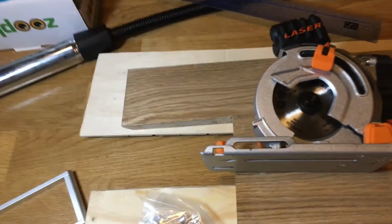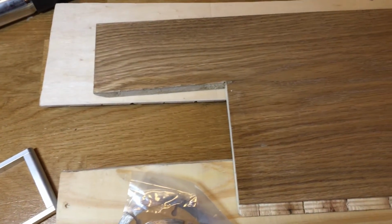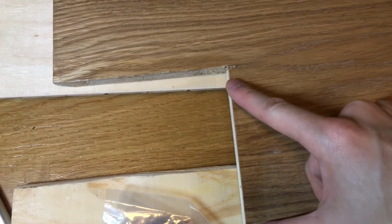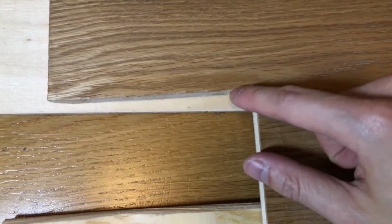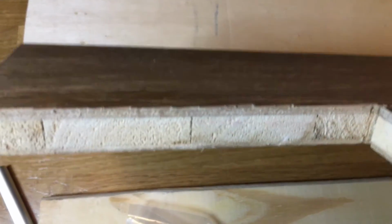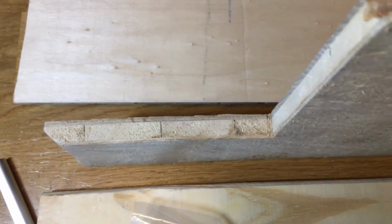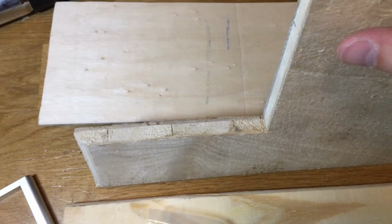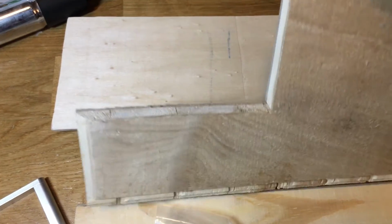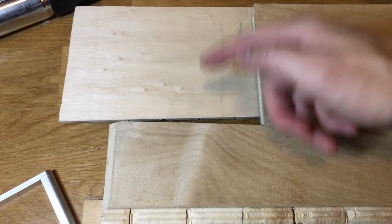Okay, so let's talk about the quality of the cut. I'm doing wood floor paneling. Just remove this, and you see that this is a very clean cut. But when it comes to something along the grain, it actually does chip a bit. You see that? But I noticed that the bottom isn't chipped. It's actually quite smooth. Maybe because of the board, but I've read in the tips that if you cut in the other direction, the bottom would be smooth. So try that.